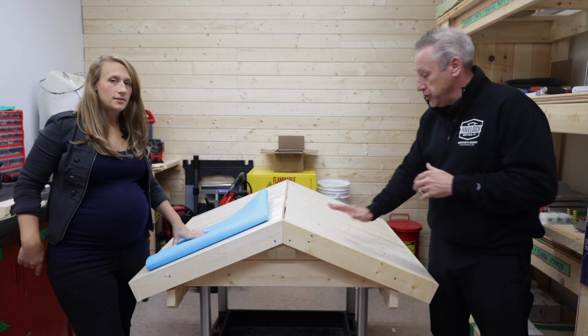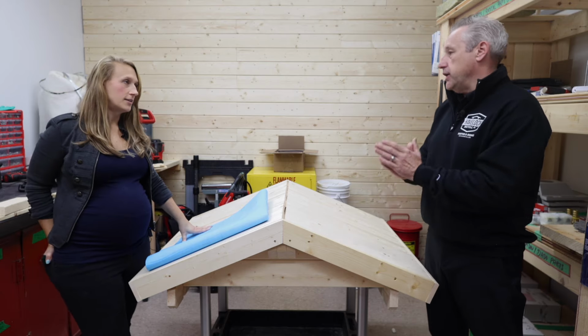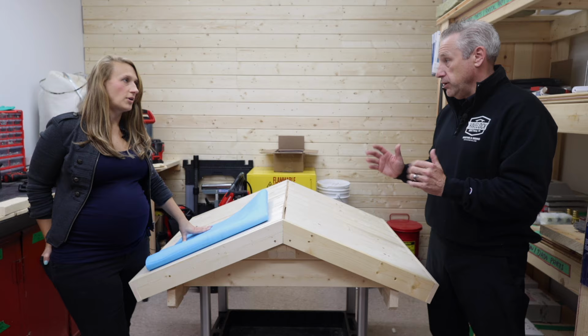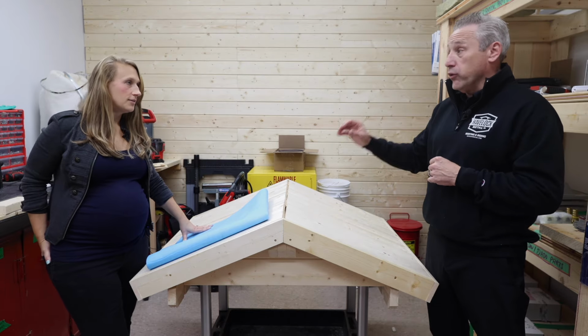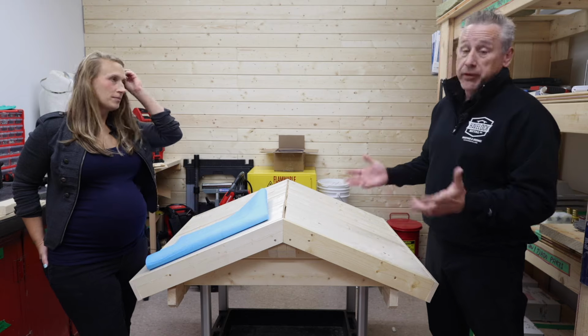Ideally, because what will happen is there is condensation that will occur under the steel as it heats and cools with temperature, sun, shade, etc. That condensation will seep into the wood and, over the long term, potentially damage the wood. We're not talking 2 years, 3 years, but long term. The bunkie roof will be good to go for 40 years, but the decking underneath might be getting a little sloppy. So we'd like to have something underneath it.